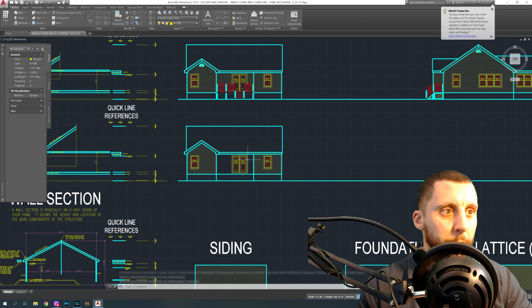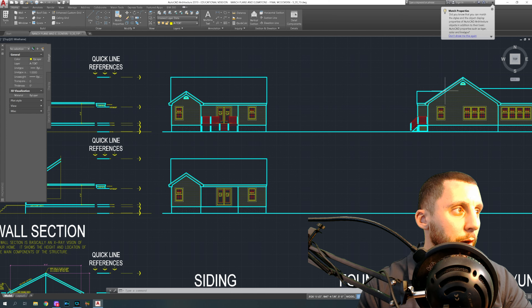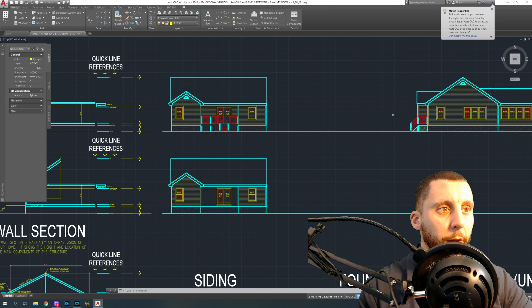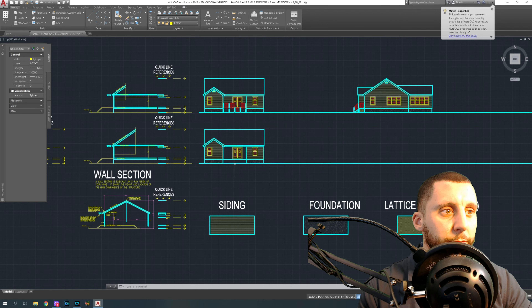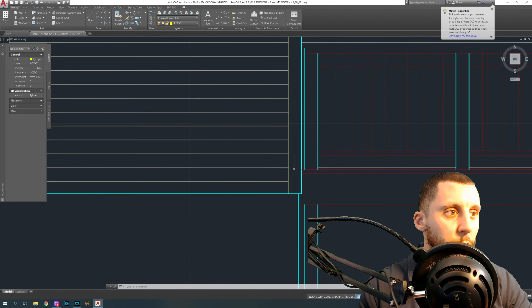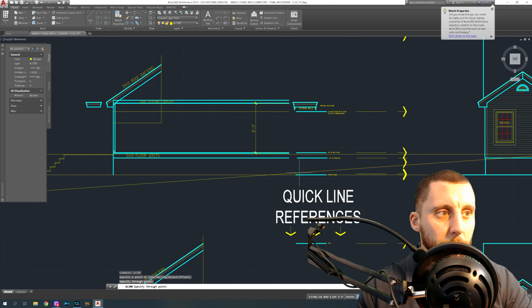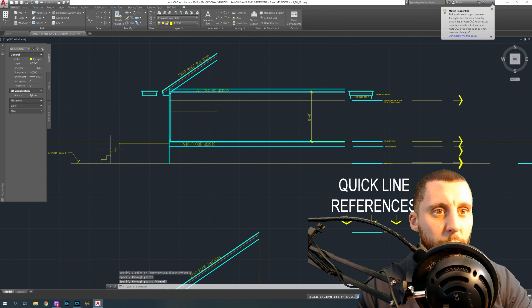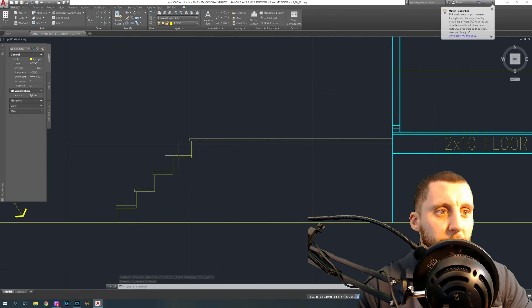Going to the side view, the peak of this gable is what we're going to bring across to get the peak of that gable running forward in front of the house. Here's what we need to make. Taking the floor — we've got our foundation line — I want to see what I lined this up with: the top of the deck. Okay, so here's what we do. The lines that we created for the stairs — we're going to do a construction line at the top and bottom of each piece of AZEK.